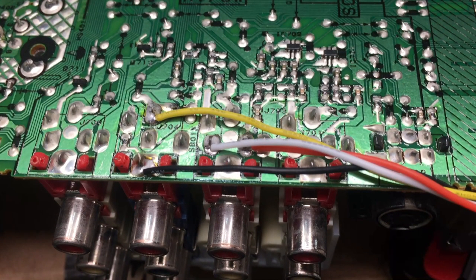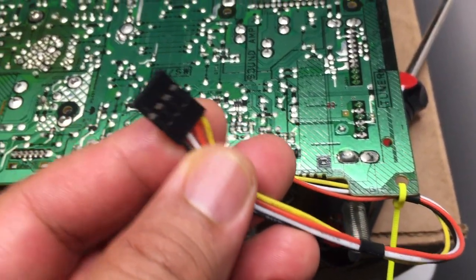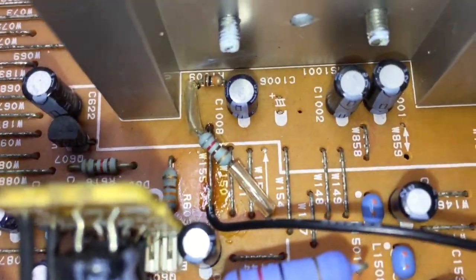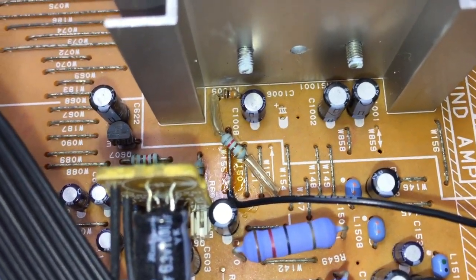The permanent audio left and right and sync and ground lines were soldered to the component jacks on the rear of the TV. This is where you can source the 5 volts. You can source it at jumper W155. This location is also marked on the CAD drawing.